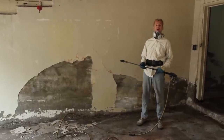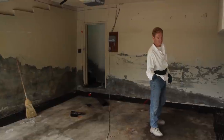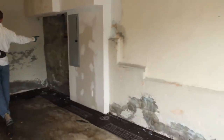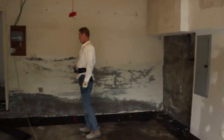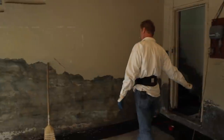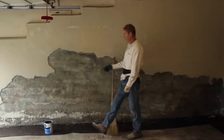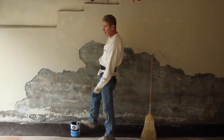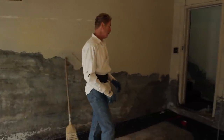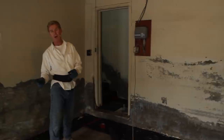Okay guys, it's a week later. Everything has had a chance to dry out — I came by yesterday to make certain. Here's what we end up with: that's the material we pulled off. The pressure washer at 3,000 PSI really pulls it off; if you hold it on long enough it'll gouge the wall. After that, we apply a bonding agent. You can use Weld-Crete, or the equal to it, Quikrete — sold at Lowe's or Home Depot. Now we're going to skim coat this.